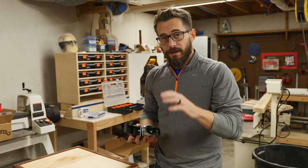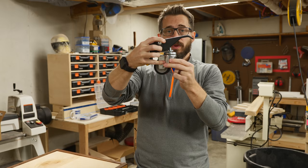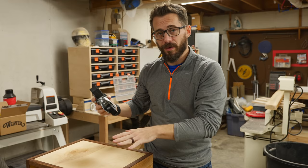The lacquer dried really quickly, so we're ready to move on there. Next, we're gonna put on these casters. Now, these fit on the side of any kind of a workbench, and they'll let you roll it around, but then if you let up on this little pedal, it lifts the caster off the ground, setting the object down fully on the ground. And so that way, this will get planted in place, it won't move around and roll while I'm trying to use the sewing machine that's on top. Let me install these, and then I'll show you what I mean.